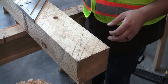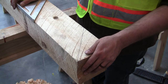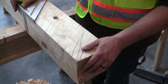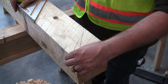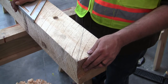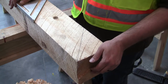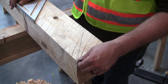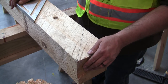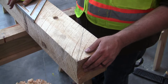What I'm going to show you now is how to lay out for the diagonal braces — also known as knee braces. In your lab manual there may be a dimension listed as 30 inches, which would be the longest side of this diagonal brace. We're actually going to adapt the plan just a little bit and go to a 36-inch long diagonal brace.